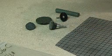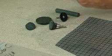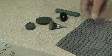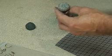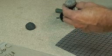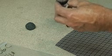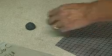I even put this hose clamp on here to try to tighten up the pattern, but some of these wires are longer than others, and it ended up digging deep circular grooves in here and didn't have that right shine pattern I was looking for. I tried 3M Scotch-Brite tools. This abrasive stuff. It's kind of like the stuff you use to wash pots and pans with, but it has a matrix of abrasive in here, and that didn't work very well either. It loads up. I tried it with oil. I tried it dry. I tried it wet. Doesn't work very good. So throw all that stuff out.